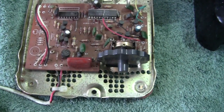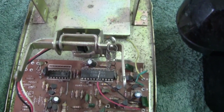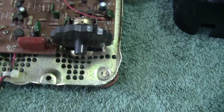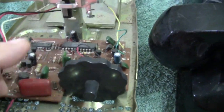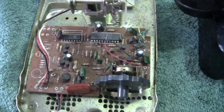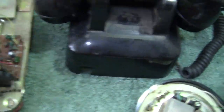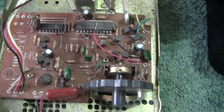What interested me was I've never ever seen the innards of a 500 type telephone quite like this. I was hoping to work out where all the connections went to, but unfortunately it's too damaged to do any further work. One of the capacitors has got one of its legs broken. There's a variable potentiometer — whether it's for lowering or making louder I don't know. The handset was also tied in there but not connected. These are spade type connectors going to this printed board.